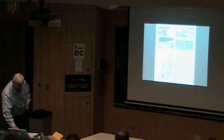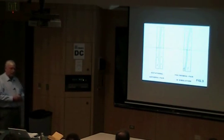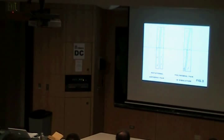And obviously you can focus if you use that. As Jim pointed out, if you think about a pair of lenses with flat surfaces and curved middle, what you put in the middle can be a little different on 2 sides, and they can be aspheres or spheres or whatever you need. And they don't change function much if you deform that airspace into a bit of an S-curve without changing its thickness. But if you've done that, and now you slide them, you get a focusing change.